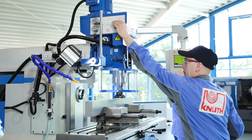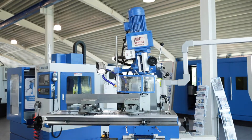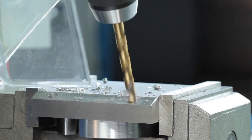The spindle speeds for horizontal and vertical spindles can be selected using separate gearboxes. The vertical milling head can be swivelled 45 degrees to the left and right. With the swivelled milling head, drilling and milling operations can also be done at an angle.